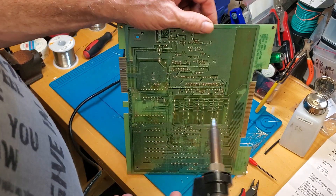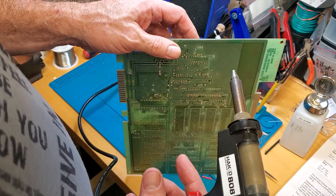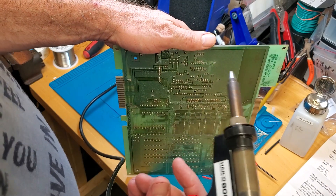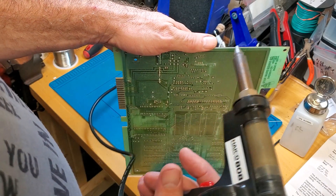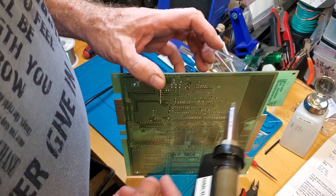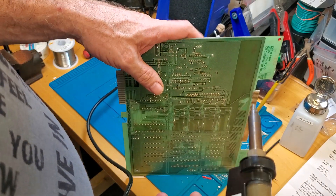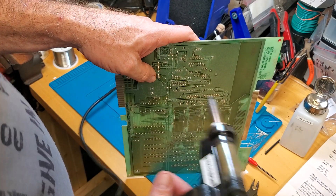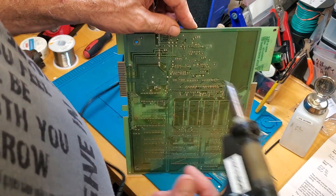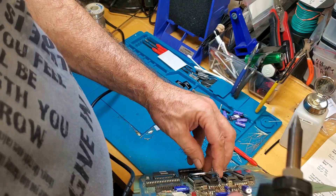It's a real art knowing how long to hold it, when it liquefies to the proper point, hitting it, wiggling, and pulling — it's a nice coordinated dance. The more you do it the more comfortable you'll get, and the quicker you can do it, which means less heat applied to the board and less risk of damaging components. It might not be a bad idea to get an old dead circuit board and just practice removing things — though keep in mind surface mount is a whole different dynamic.